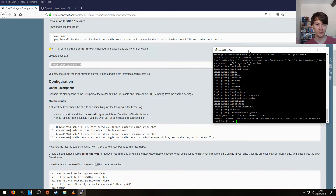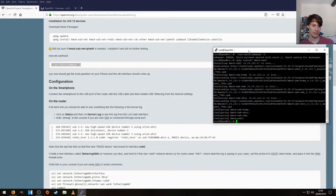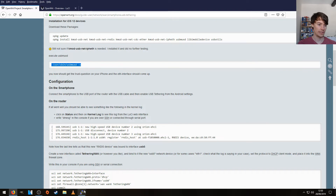Remembering this router from a while ago — if we install the USB 2 KMOD that might bring it back up. So we'll just do OPKG install KMOD USB 2. There you go — the phone has lit up and it's made a sound, so that's a good start. Let's just run that command again.